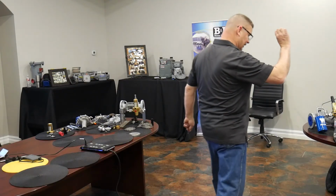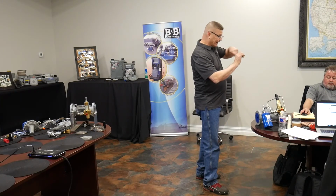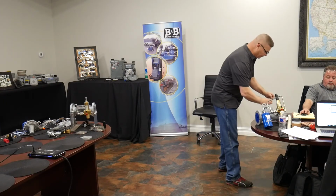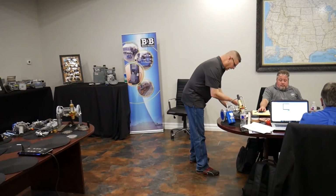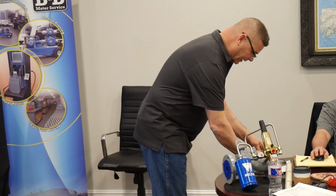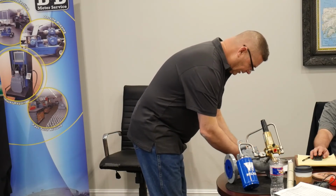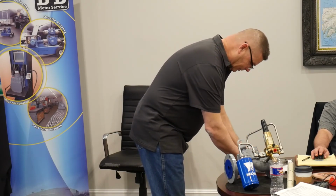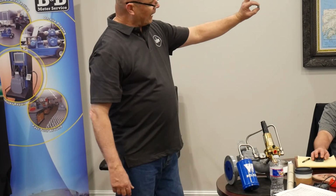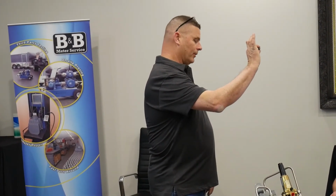Okay, because it has an O-ring that seals the orifice from falling out. That's a good thing. It's not letting gas around the orifice. I want to make sure it goes through the orifice. So I have to push it out to get it out. And there's the little orifice O-ring that has to come with it. And there's a little spacer to keep everything properly aligned. So I get this little, I call it an Oreo cookie sandwich, but it's really not the right colors or texture. But I have an O-ring and I have a spacer, and that's the place the gas is going to pass through to get to the outlet.